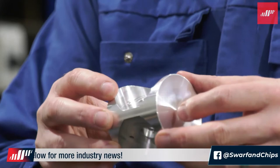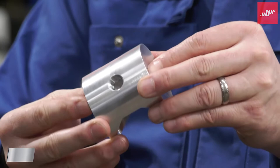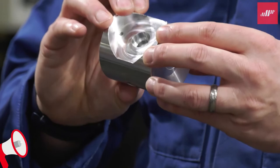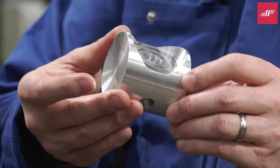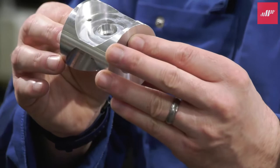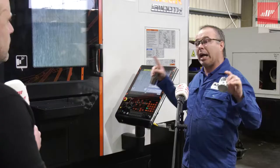Definitely. This is a medical company that came to us with a particular problem — basically with what's going on at the moment — in that they needed to increase capacity within the wards. So they redesigned a component which basically went from one oxygen branch to two, and they came to us to see if we could help with the manufacture of the components. With a typical part like this, if you look at the ports on there, there's three different ports around it, as well as engraving on the end. The ability of this machine, with the amount of live tooling and the twin turrets, gave us the option to load up the machine to be able to machine something like this in around about 10 minutes.